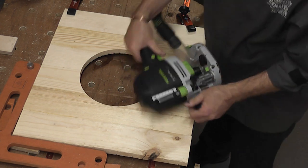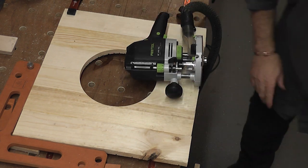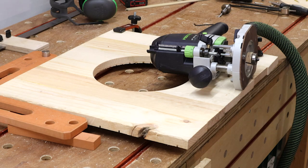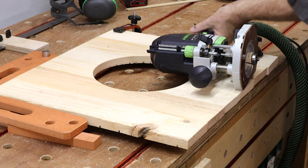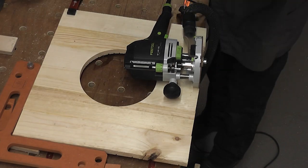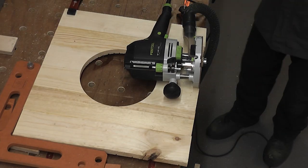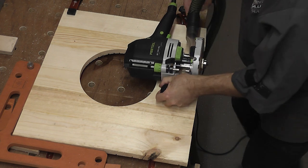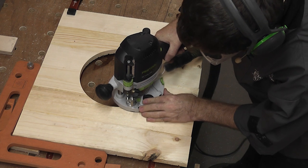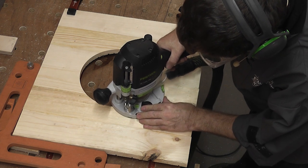Hoover hose back on. We've set our depth, we can lock it off there. Just checking for the cable now, it's down there, look. So, goggles and earmuffs are at the ready. Check it's off, it's on there. Put that on, so goggles on. So there, I can lift everything up carefully, try and get stability. Put on, gently coming over. Start our cut.